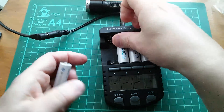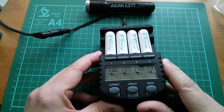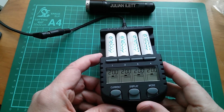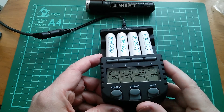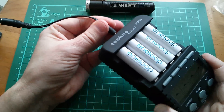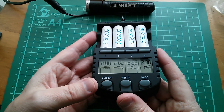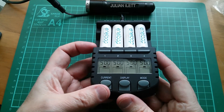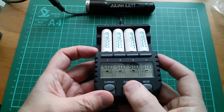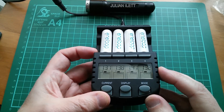Just happened to be some Eneloops lying on my desk, probably waiting for a charge. Let's put them in and see what we've got. Different voltages - it defaults to 200 milliamps. 200 milliamps is not the best current to charge these at because it has problems terminating at 200 milliamps, as the other one did. Let's unplug it and plug it back in - and when it shows the current 200, I'm going to increase that to 500 and charge these all at 500 milliamps. Now they're away charging at 500 milliamps. I can press that button and see the voltages - this one's a little bit ahead; the others are all at about 1.3 something.